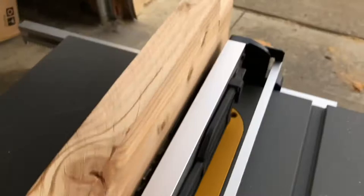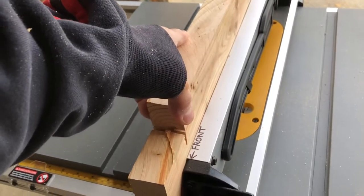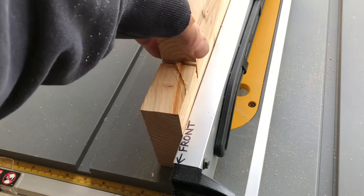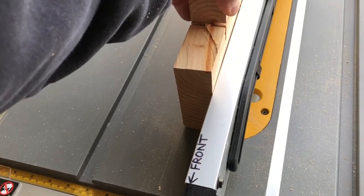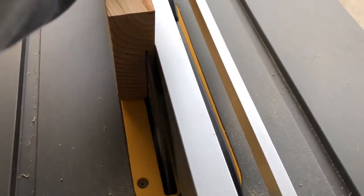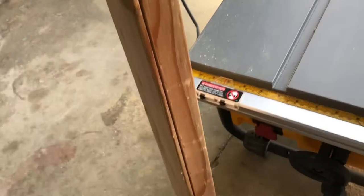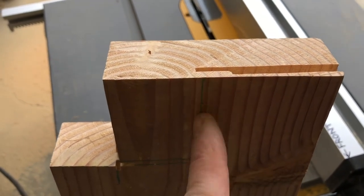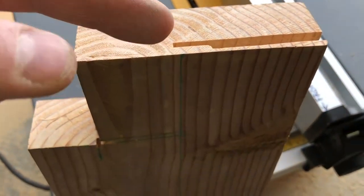Out here, set up for the height needed — it goes just a hair over where I marked. I need to gouge this out for the depth it's going to take. I put a slice in it in that direction at the depth needed, and now I'm going to put a slice this way at that 3/8 inch depth, and gouge out that entire corner.